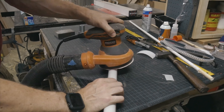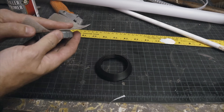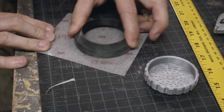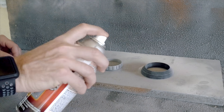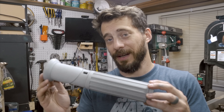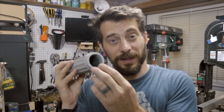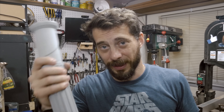There was one last step to diffuse the outside of the blade — running over the entire thing with a sander or sanding block. The pieces off the printer also needed to be sanded down and prepped for paint. Sanding takes down some of the build lines and makes it easier for the filler primer to even out the surface. I do two coats of filler primer with a light sanding in between and you end up with a pretty smooth surface. Now that I have the handle finally printed out, I can see it's just too big. The inside diameter can't change because it's set to fit the speaker just perfectly, but the walls are just a little bit too thick, which makes the outside really big — it kind of feels like a flashlight more than a lightsaber.